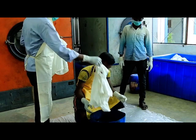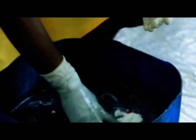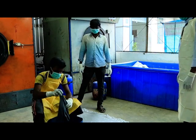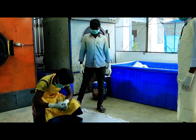More fashionable effects can be generated by the process of cold pigment dyeing. The stitched garment will be dipped into the dye bath, slowly be patted by hand and left for soaking for about 2 minutes. The time varies depending on how broad the effect shall look like in the end. The garment has to be carefully squeezed. Twisting would lead to unwanted streaks and stains.